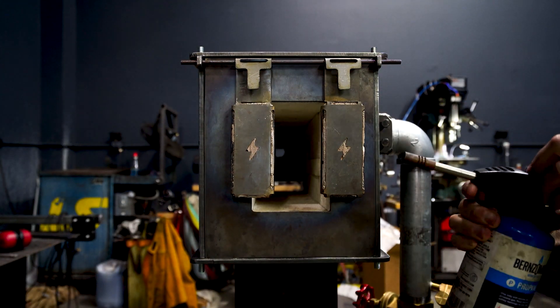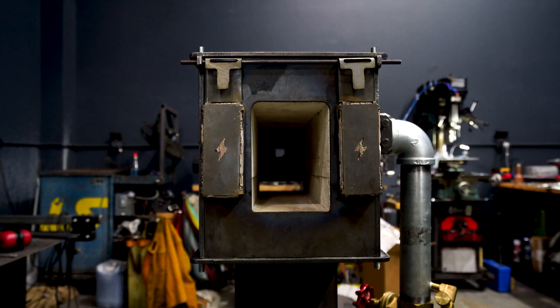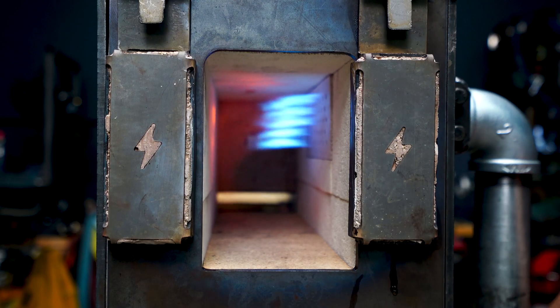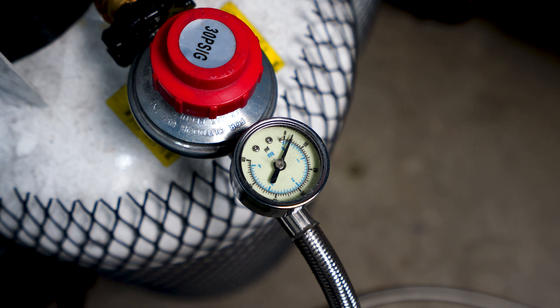We did get a chance to test fire. We were working on figuring out that ribbon burner problem, tested it — it was not good, so we scrapped that. Then we test fired the Apollo Forge as a whole unit. In the time-lapse videos you're not seeing some of the ceramic blanket that gets put inside — those were just test fit-up videos made during the fitting process. There is a ceramic blanket that protects the steel against the radiation of heat from the insulating fire brick. One thing that's really important to understand when building a forge is efficiency. Atmospheric burners burn at specific efficiency, and ribbon burners — I've heard stories about people increasing efficiency by 50%, but I'm not convinced a ribbon burner is any more efficient than an atmospheric burner as far as fuel consumption. What I am convinced of is how evenly it spreads heat throughout the forge itself.